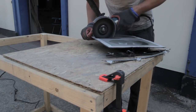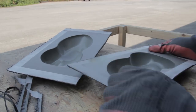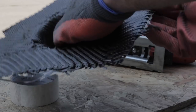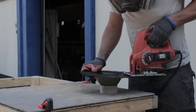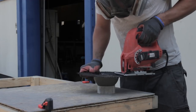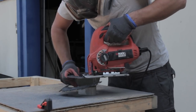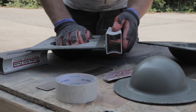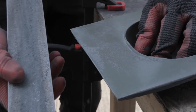I still use the Dremel and Perma-Grit rotary tool for smaller cuts. Here's a second mold I made — it has some retouches from air voids. For cutting more difficult curved shapes, I place a roll of tape under the bowl shape for support, then use a jigsaw with a Perma-Grit jigsaw blade that has carbide or near-diamond toothing — it cuts very well. I like my mold edges as straight as possible because straight edges make taping around the mold much easier.